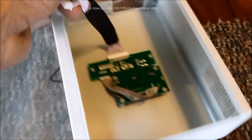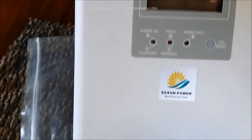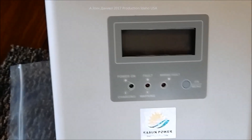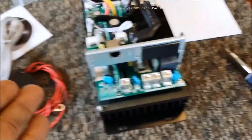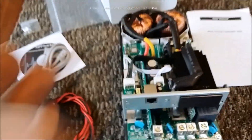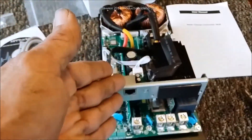Inside, a connector goes to the front control panel — it just comes loose and you can lay it aside. The front panel is not designed to fully operate this unit; you do need the remote programming capabilities of your laptop and the software. Once you program it to your parameters, you don't need to leave the laptop connected.